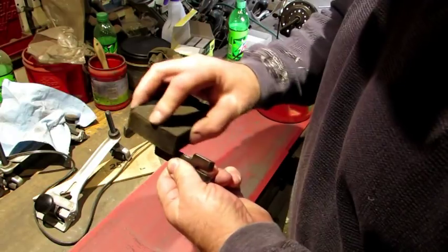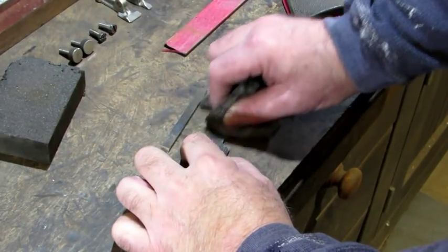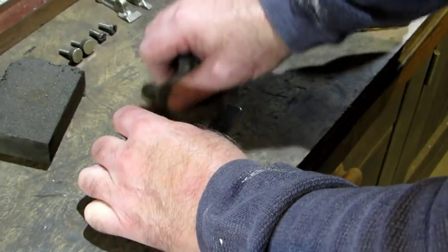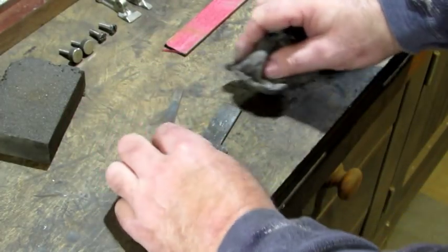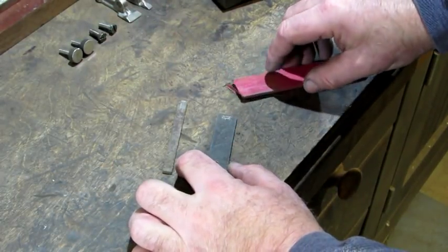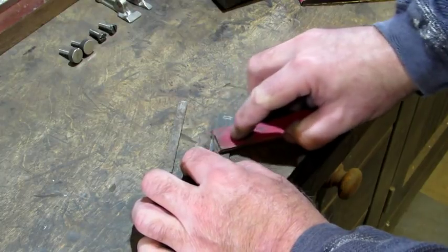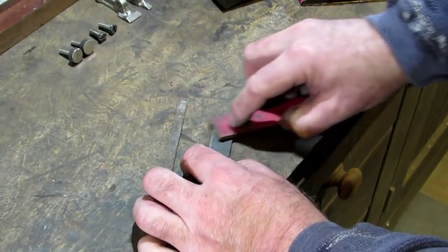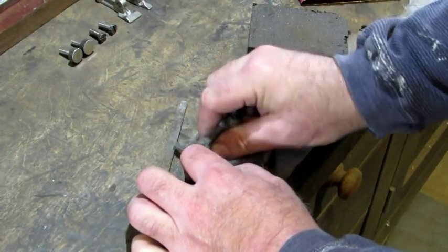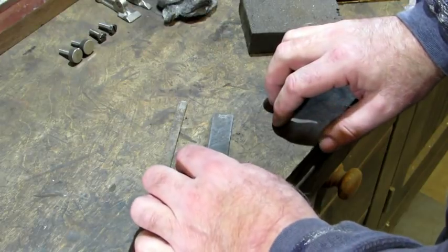Both sides of the small iron are machined — same thing, lapping station or sanding block. The edges of the large iron that are not machined flat, a worn-out old sanding sponge works real good for cleaning those up. The back sides of these irons are not machined flat; steel wool will work fine on them. I can use the steel wool and when I'm done I can still see the bluish tone from when they tempered the irons — and that's what I want to keep. If you're not worried about the original machining marks on the front sides you can take it straight to a lapping station; otherwise use a sanding stick held perfectly flat and run it in the same direction as the machine marks. Then my old worn-out sanding sponge and a little 4-aught steel wool, and it's cleaned up good — not looking like brand new but the original machine marks are there.